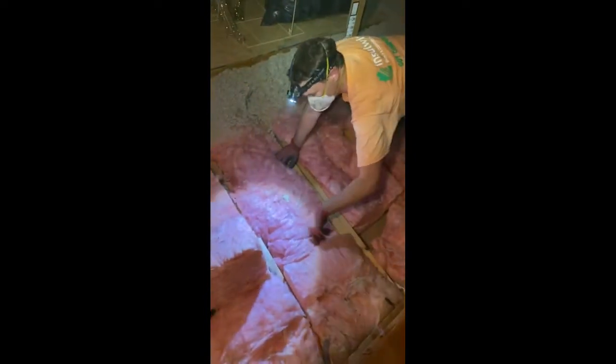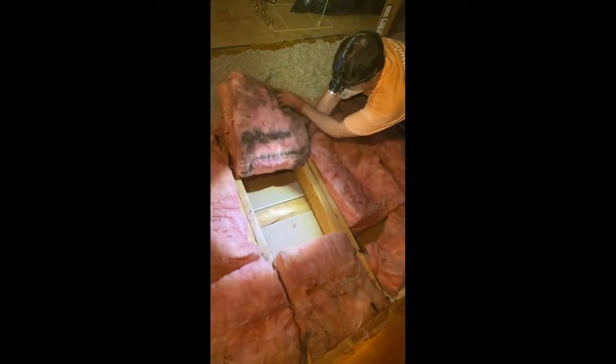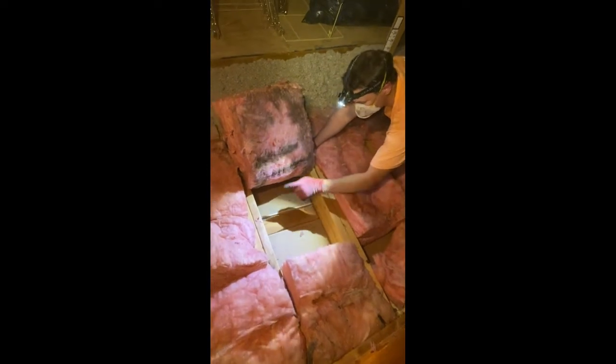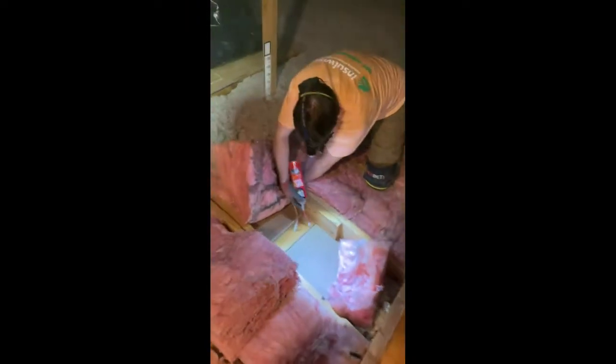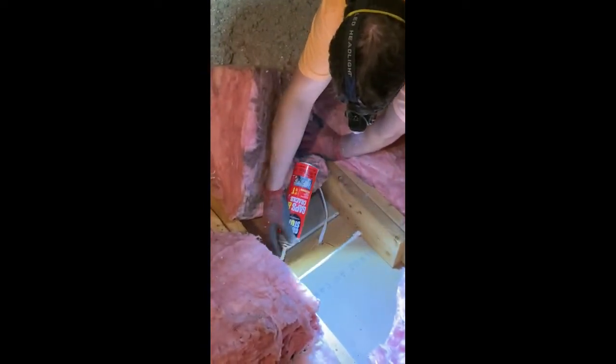My guess is that we'll find another one right next to it. And there it is again. So you see it's solid pink here where the stud is, and black lines on either side where the air is escaping up through it. And all that we do at InsulWise is methodically move through your attic spaces, find these things, and seal them with foam.